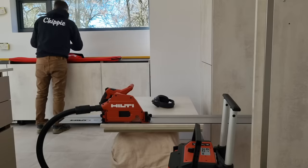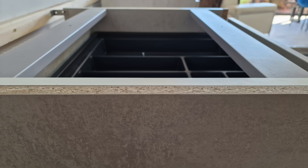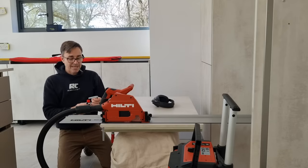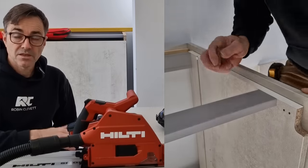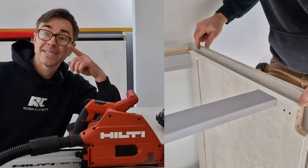We put the rail up to a line and clamp it on - it's really important to clamp it on. I'm cutting an actual piece of kitchen here, an end panel. I'm cutting through the back because if you're going to cut a laminated or veneered board, with a circular saw you want to cut from the back side. That way we'll have a perfect cut on the other side, and we'll also be able to see the quality of the cut on this side as well.